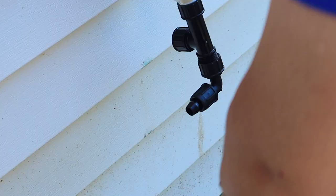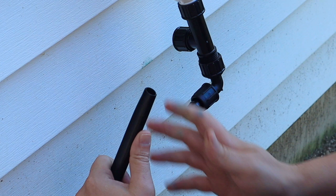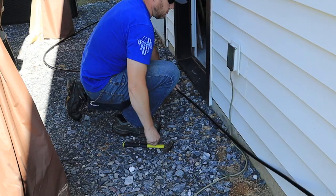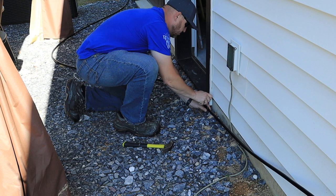This is nothing more than a compression fitting. If your half-inch line is a little cold, either set it out in the sun or warm it up with some hot water. Then all you have to do is push this on here and tighten up the compression fitting. This is a temporary installation for this line, so I'm not too concerned about making it look pretty right now — I'll do that some other time.